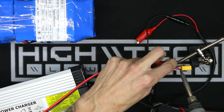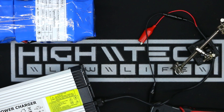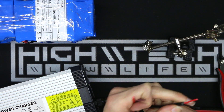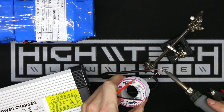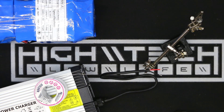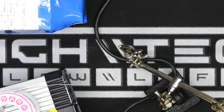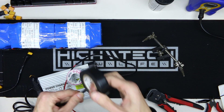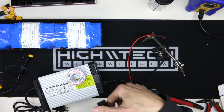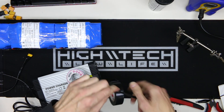This pack did not come with a charger so I had to buy one separately — it just had these weird clip-ons for charging, so I'm putting an XT60 connector on it to mate with the battery so I can charge it. I have heard you're not supposed to run packs like this together with their own separate BMS's, but I've seen other people do it and haven't had any problems — though take that with a grain of salt and do your own research on what you should and shouldn't do.